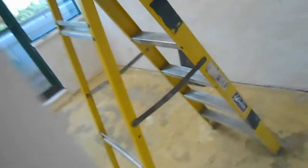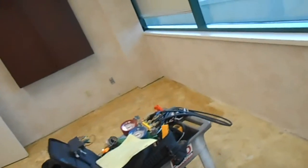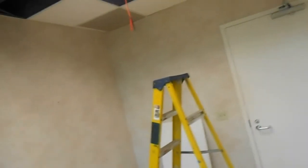So we're in cooling right now — kick it over to heat, cuts out instantly. But then it holds. That's almost got to be a problem with the thermostat. It's an old mercury bulb thermostat. Usually a mechanical thermostat like that won't have any internal problem causing something of this nature. The pressure switches are wired up, so if there's any pressure issue it'd be cutting out. I might just put a new thermostat on there and see if that doesn't solve things. I'm going to check the amp draw and fire it back up again to see what we find out.